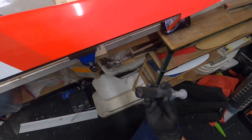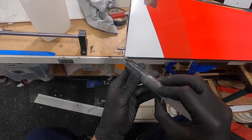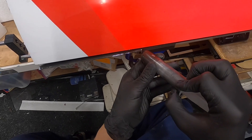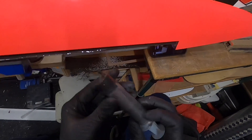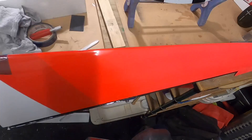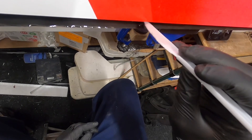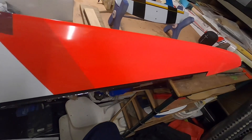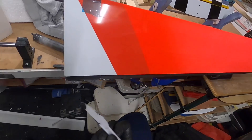I'm going to sit on the step stool, make sure I'm nice and steady. I'm now going to syringe some compound along in place here. You want enough thickness that it's going to hold together and fill up some low spots. You can see it's self-leveling but still holding a bit of height. I'm happy with that thickness and how it's sitting — make sure it's all sitting flat or thereabouts. Yeah, that's just leveled off a bit nicer.